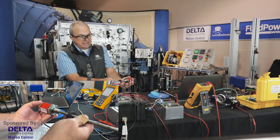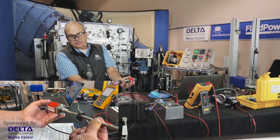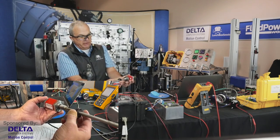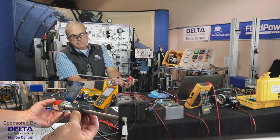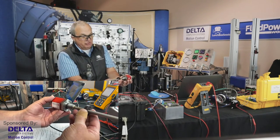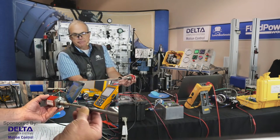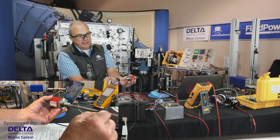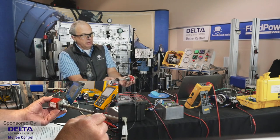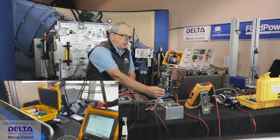So the rod itself inside the cylinder has to be gun drilled hollow to receive the probe loosely with a clearance fit around it. And then typically a magnet is mounted, screwed to the back of the piston. So if you imagine the cylinder extending and retracting, this magnet is on the back end of the piston, and that's what makes up the technology that we're calling magnetostrictive, very popular.